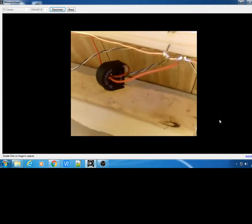As you can see if I walk around the track, you can see that copper wire going all the way around, and from the copper wire I have my connections that go through the CT transformers. It's just soldered off the 1mm copper track, through the CT, and then up onto the tracks. The two blue and white wires coming out go up to my Arduinos.